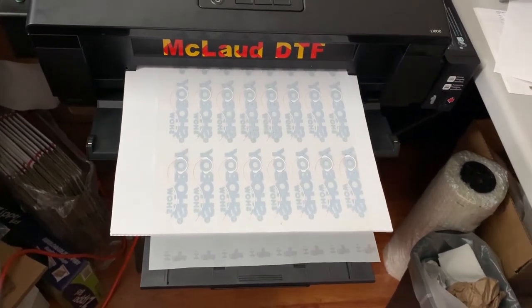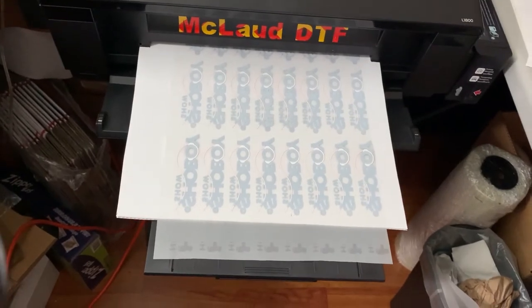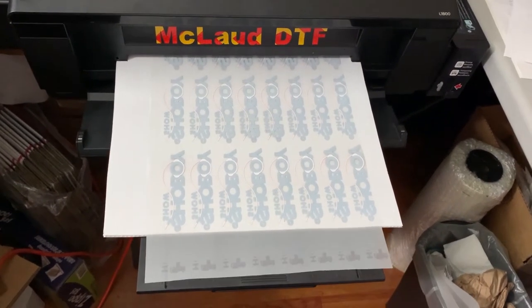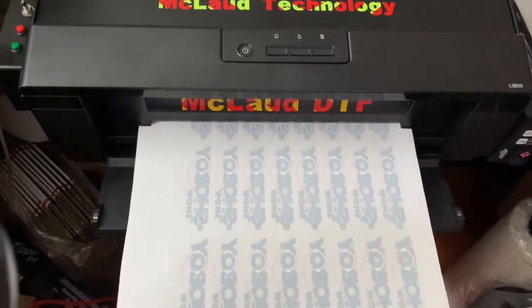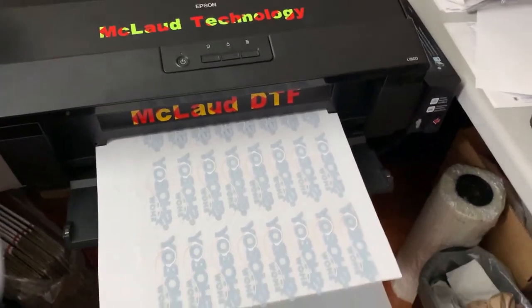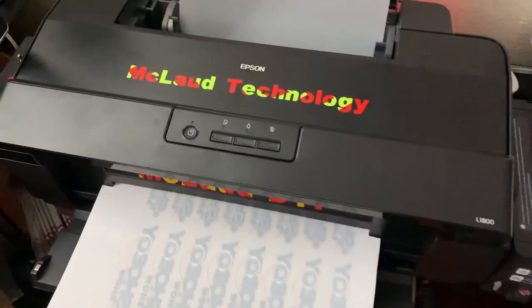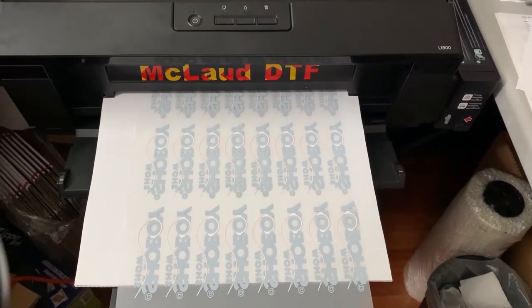But if you are using the roller, all you have to do is just reverse it back up like a car reversing. No feeding problem. Once you try this kind of roll printer, you will never go back to sheet printing. You also throw a lot of money on sheet film because there's a lot of waste — you produce an A3 and sometimes you don't need the whole A3. And if you are buying printers from somebody who doesn't know how to convert, there's always two inches at the bottom that cannot be printed.